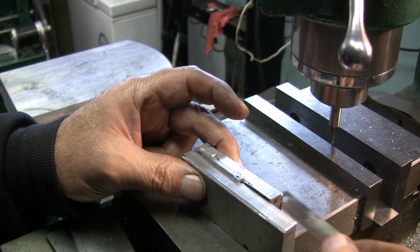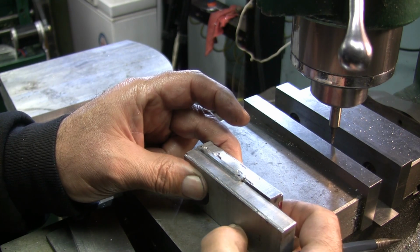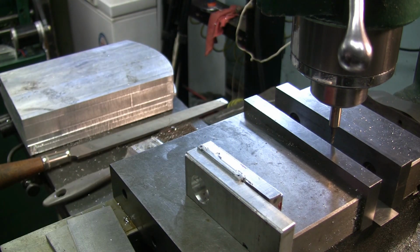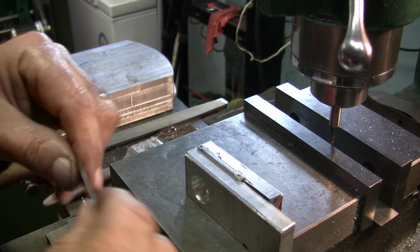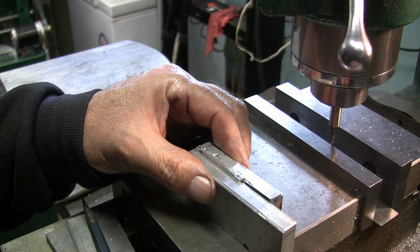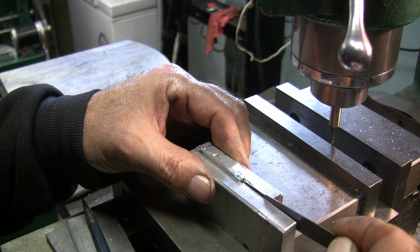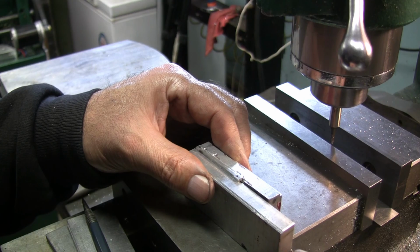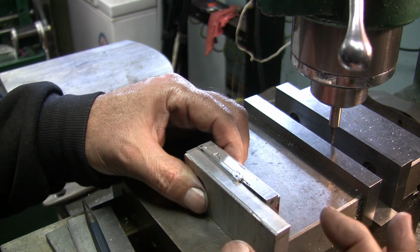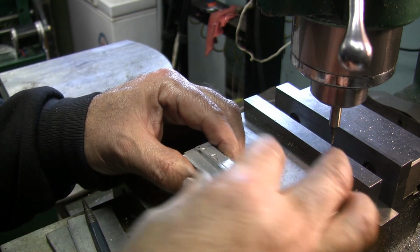But when I tried that, naturally the bottom is going to collapse together and it's going to spit it out. So I had to figure out at what size feeler gauge I needed down at the bottom. I calculated that I needed a 25 thou feeler gauge. So I set the feeler gauge down at the bottom of it. Now it actually tips it in a little bit and grips it nice and tight.